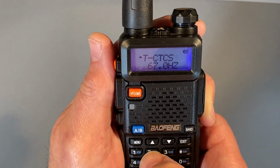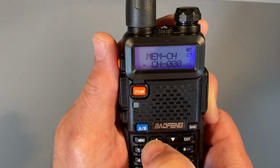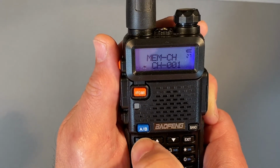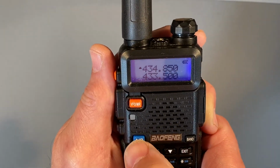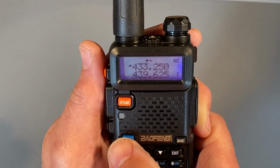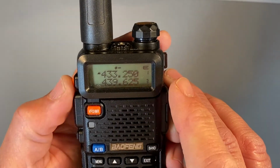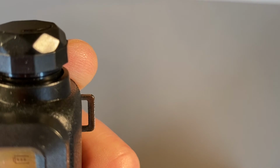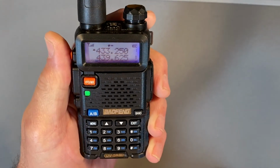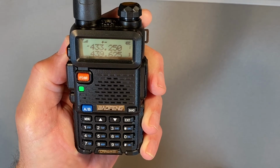Menu 27, which is a channel. Menu again to go to the bottom. Find our channel, channel 1. Menu. Transmitting memory. That's it, it's done. So if we go now to the memory channels, you can see number 1 with the frequencies we put in, and we'll try that again. This is M7IVY, checking repeater access. And there you go, we're in.